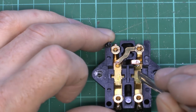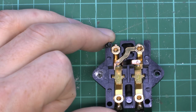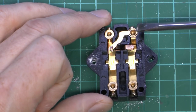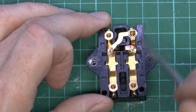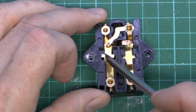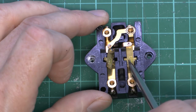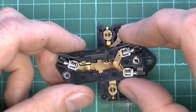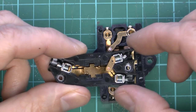So that would be in the crossed-over position, and then when it goes back it goes to the straight-through position. Now if you wanted to use this just as a normal one-way switch with two terminals, you just use this terminal and this terminal — in one position they're connected, and in the other position they are not. So you're basically just ignoring the other two terminals over here, and it's either straight through or no connection whatsoever. And if you wanted to use it as a two-way switch, then you just ignore one of the top terminals, and then all you get is simply the straight through and then the crossover — and just don't connect that terminal at all. So it can be used for both. As we saw, the two-way can also be used as a one-way, simply by ignoring one of the terminals at the bottom — or in the case of the other one, it's just basically a lump of plastic instead of the threaded item.